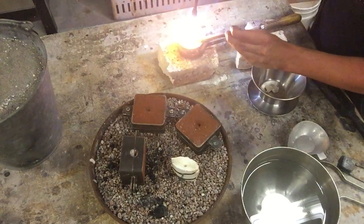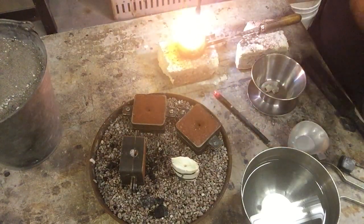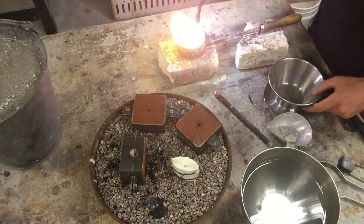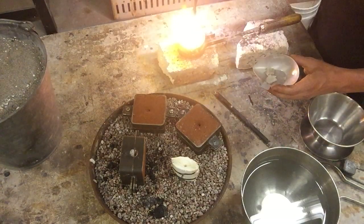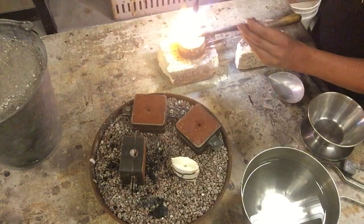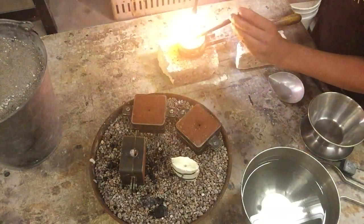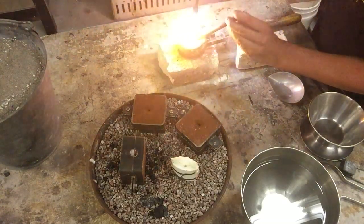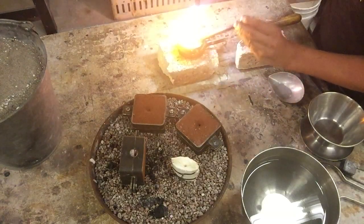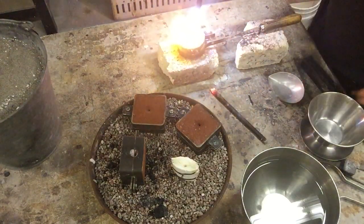We're still waiting for a nice uniform flow. We're going to add the last of our metal here. We want this to flow really smoothly — right now it's a little sticky, it's viscous. When I stir it you can see it's got some rebound, it's more reminiscent of pudding than of a fluid. You want this to flow like water — like 1800-degree water.